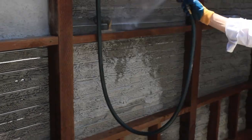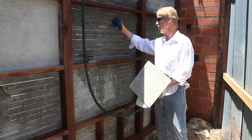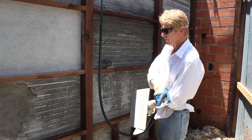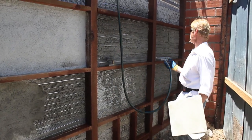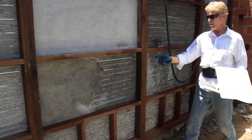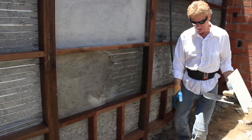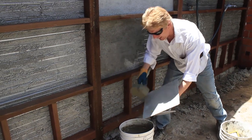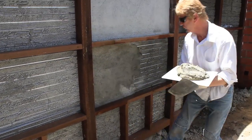Right here, I'm hydrating this wall, and this is an excess of water, meaning if I put my stucco on this, it's not going to set very well because it's an excess. But I'm starting here first. So I wet this, then I keep wetting this, so when I get ready to do this wall, it's already hydrated. Anyhow, this is the cold joint. This is the question I was originally asked. I'm going all over the place. I do tend to ramble, guys, but anyway, that answers the question of cold joints.